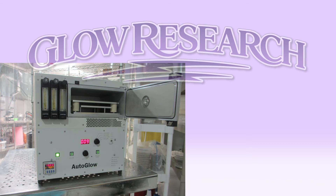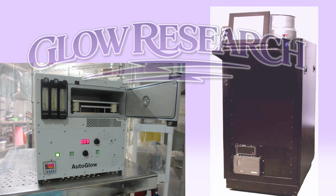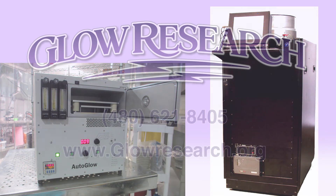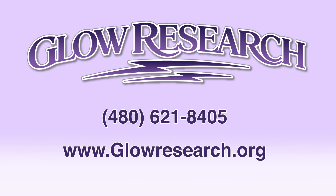The AutoGlow 200 can operate with up to 600 watts of power with options for endpoint control and DC bias monitoring. For precision reactive ion etching, we now offer the ST1200 for RIE etching of oxides, nitrides, and other films. This single wafer system can accommodate up to 200-millimeter wafers and comes with sophisticated processing software for advanced etching. Please contact Glow Research for more information on any of our plasma products. Please know that we are at your service.